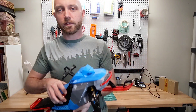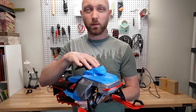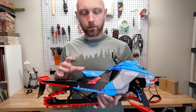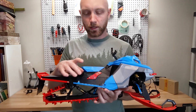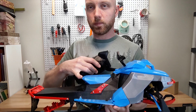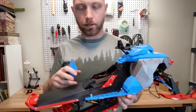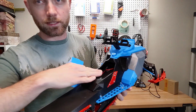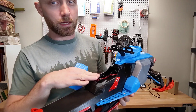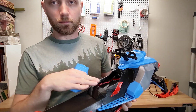Another thing about the battery is that there's not a lot of space inside for one — I was only able to fit up to a 2000 milliamp hour 3S battery in the compartment. To fix that and fit a bigger battery, they've created a seat mod. This seat is actually a two-piece design: the original one-piece seat has a blue section that pops right off, and inside you can slide in a much bigger battery. I think you could probably fit a 5000 milliamp hour 3S soft-case battery in there with just enough room.